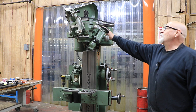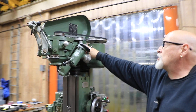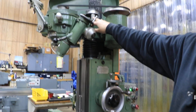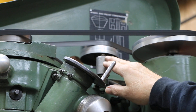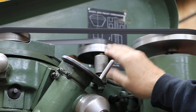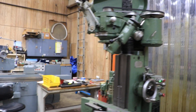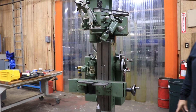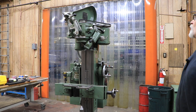The noise that you hear right now is coming from this little middle idler pulley. We wanted to get this video done, but I do have a bearing on order for it. When that bearing is replaced, the machine is going to be a lot quieter. It's a small bearing and it's constantly spinning, so it wears out before anything else.